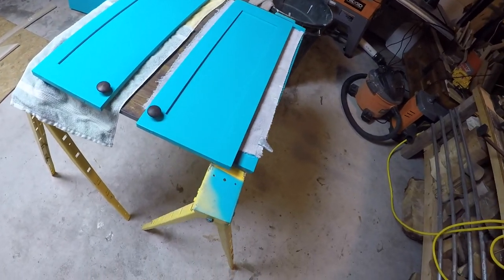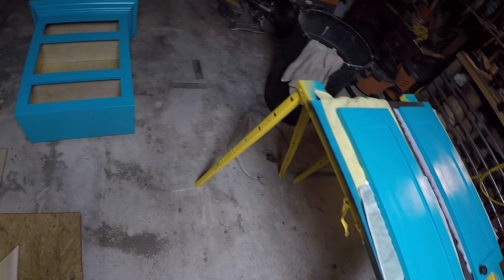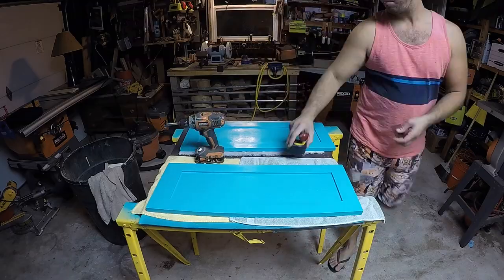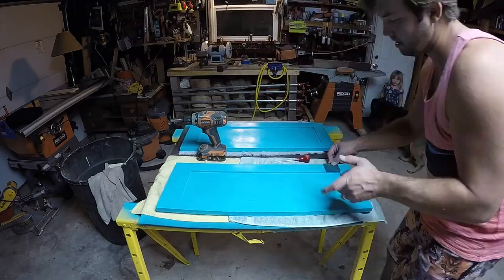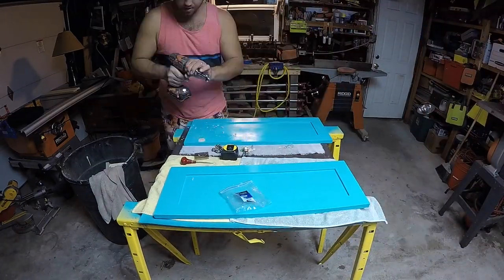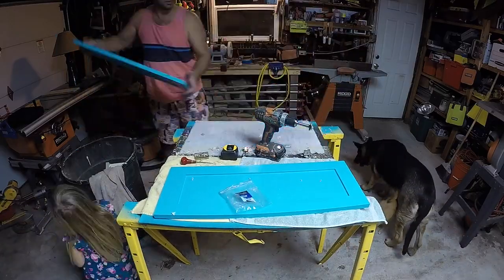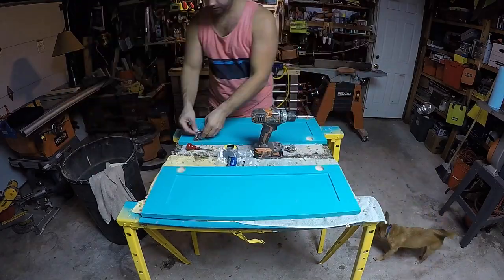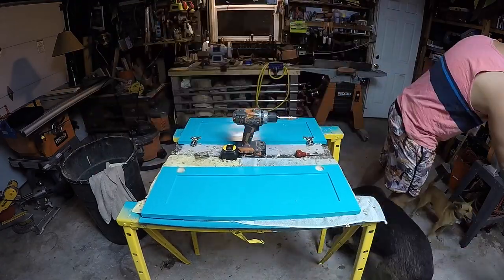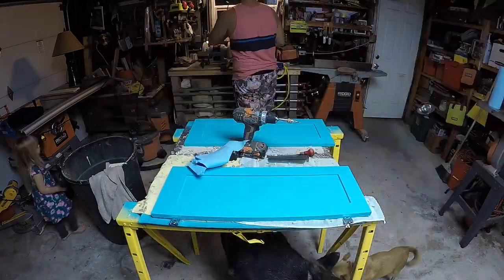I am really impressed with the quality of the spray can finish — absolutely amazing, I'm super happy with it. I'm measuring down 3.5 inches from the top rail and bottom rail and using this wonderful little jig that makes installing these soft-close hinges a breeze. It gives you all the locations — you just punch them out with your awl, drill them out, and you are good to go.